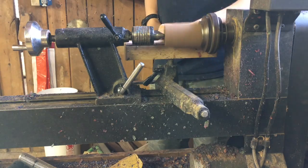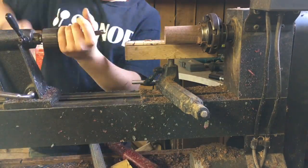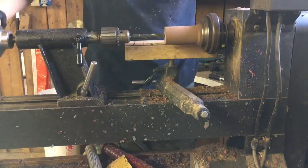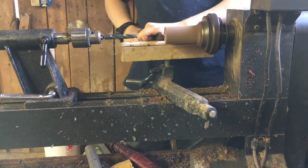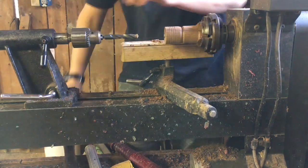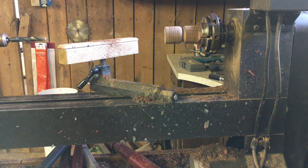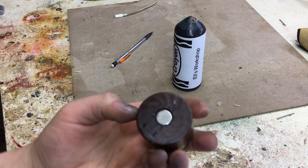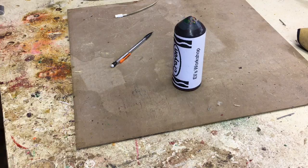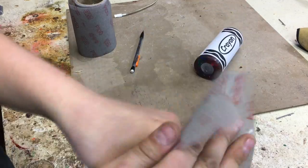Once that was done I needed a knob with a magnet in the bottom so you could pull the plug out of the crayon — instead of just using the bare magnet I wanted something you could hold. I used a piece of walnut on the wood lathe and came up with a little ball shape, put a couple of lines in it, then sanded it, and drilled a hole in the bottom for the magnet. I finished it with Blacken, and once I parted it off the top was a little rough from the saw, so I sanded the top. That was the final step.